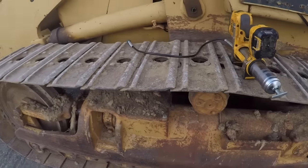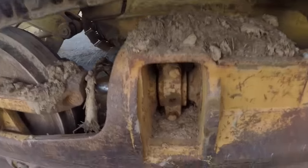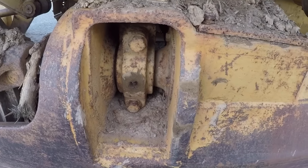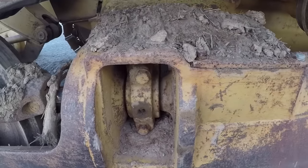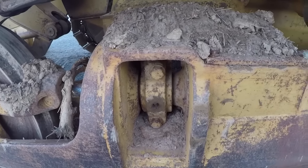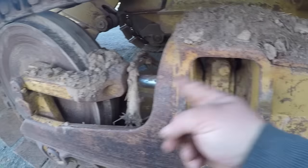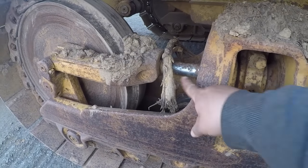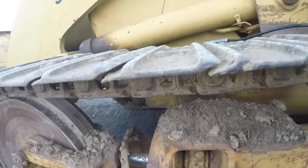They last maybe 10 to 15 tubes of grease and then you've got to put a new one on. But the one place I have used the locking lube and liked it is pumping up the tracks. If you can get it on there — this one's got a little hole, but most of our excavators don't have that hole. When you stick it on there, you can lock it on and just hold the grease gun and pump grease into the tracks to tighten them. This little cylinder is actually pushed out by grease to tighten these tracks.